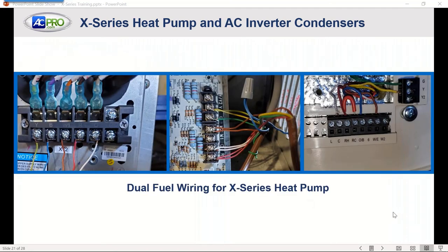This is a unit we've got here in Arizona that is operational — we did some testing on this. The left-hand side is your terminal block for the heat pump outdoor unit. In the middle is a two-stage variable-speed Maytag gas furnace. The gray wire nut with two blue wires takes the OB terminal from the thermostat to the B terminal of the outdoor unit. The reversing valve in this system is energized in heating mode, so if there's ever a failure in higher-temperature areas, cooling will still work.